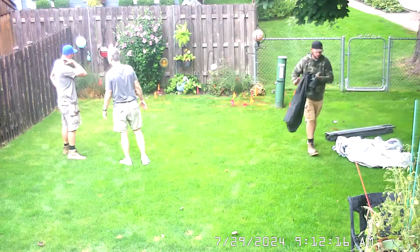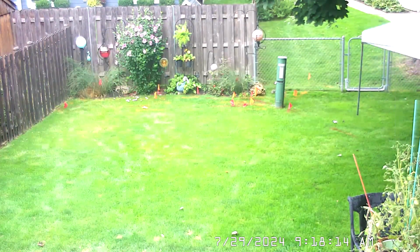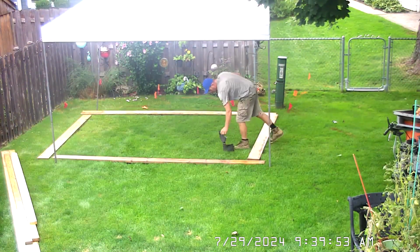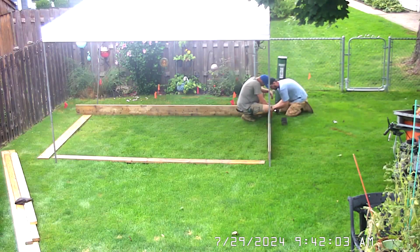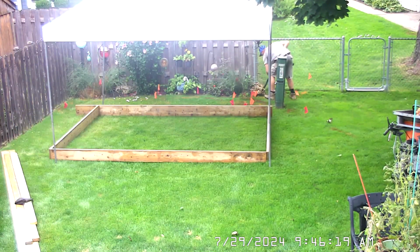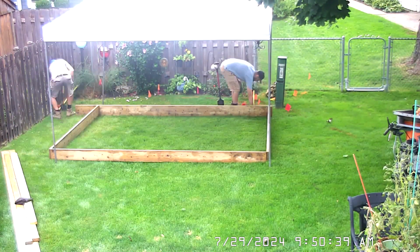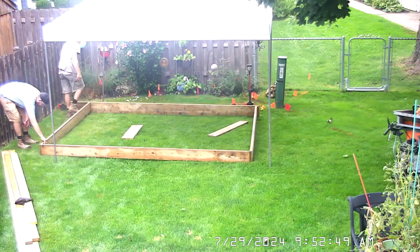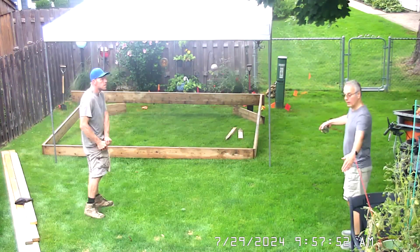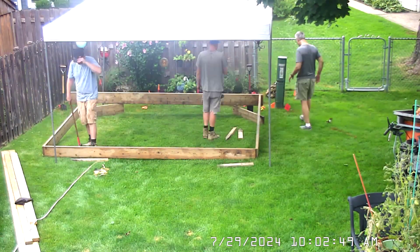I chose a concrete contractor who specializes in building slabs. On framing day, we discussed the pad should be adjacent to the back easement and 3 feet from the next door neighbor, per the village requirements. The 10-foot by 12-foot frame was sized a half-inch smaller to ensure the Tuff Shed siding had no problems overlapping the slab. As it turned out, this shrinking of the dimensions was not needed.